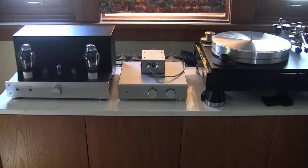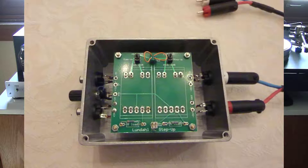The only problem is to identify a transformer that is of sufficiently high quality that it does so without degrading the signal quality in the process. The Lundahl LL1931 Phono SUT provides 18 or 24 dB of gain, selectable via two miniature toggle switches. The 18 dB setting works with cartridges requiring from 200 to 600 ohms of load impedance. The 24 dB setting works with cartridges from 20 to 160 ohms of load impedance.